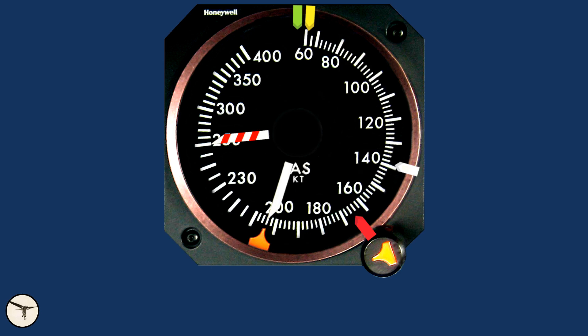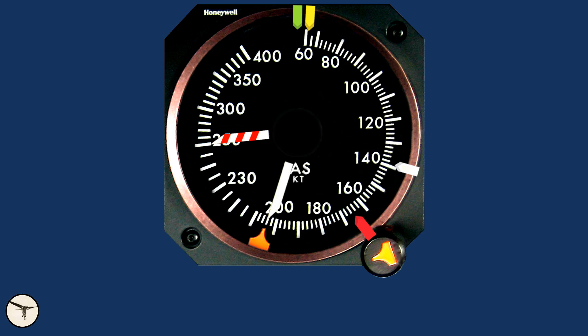With ice on the wing, the airspeed indicator shows a red bug called the icing bug. It can slide back and forth on the ring and you set it to the weight of the aircraft. In this case the crew had set the icing bug at 165 knots, giving a weight of roughly 22 tons or slightly below. That would give a cruise speed of around 204 knots, give or take, depending on the actual temperature of the air.